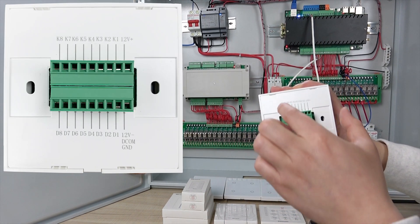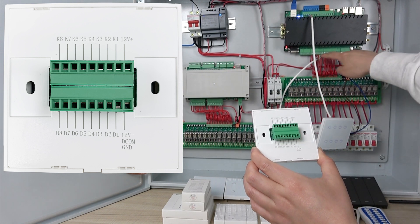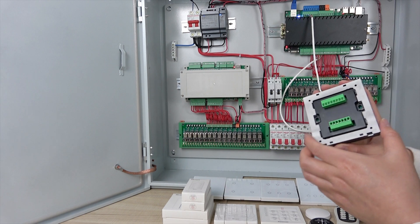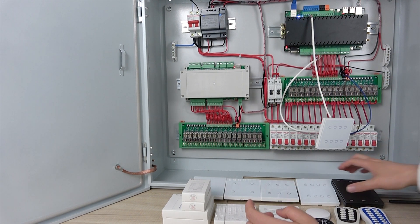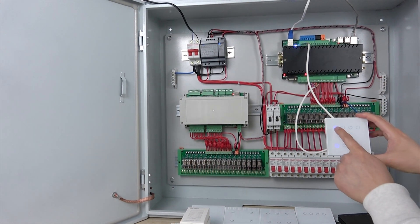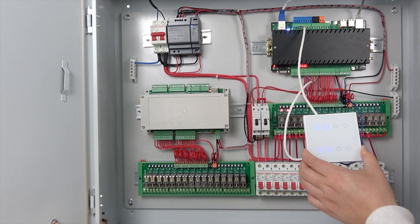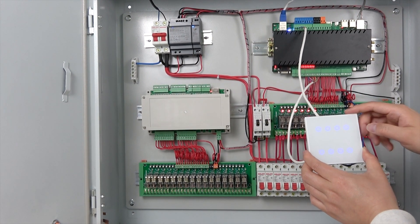You can see here is the dry contact for the button, for the digital input. And this is the LED indicator kit — from this output, digital output — so that can indicate as LED. This also has 12V power supply, 12V and ground. But for this board you don't need to use the 12V power supply, just the dry contact line, because this is the touch mode. I have connected it with this touch mode. You can see I can turn on channels one through eight. This is the wall switch.